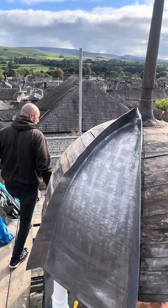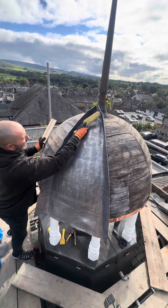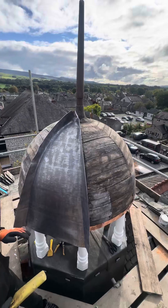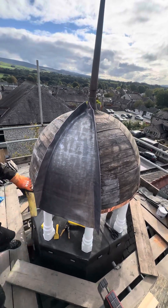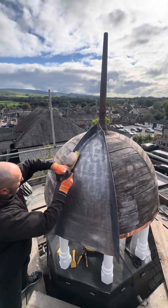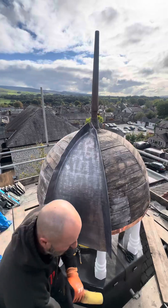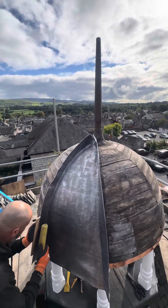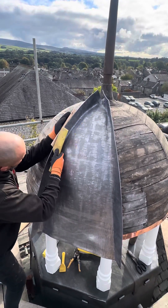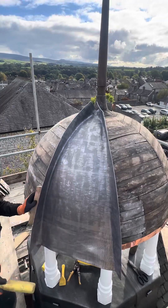I'm just going to do a little bit with wood. When you do your initial fold up — well it's a triangle — you don't dress it in sharp, because that will never be your final place where your welted joint is going to fold. A nice soft fold initially until you're at this stage, and then you can start really getting it just in. Bit of wood behind there. That's one side done.